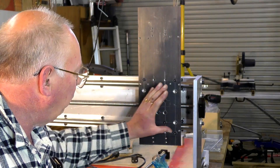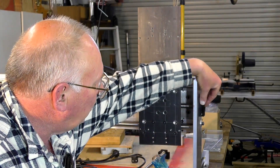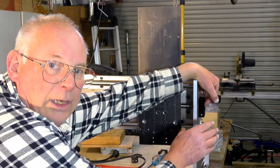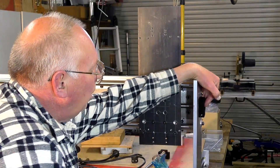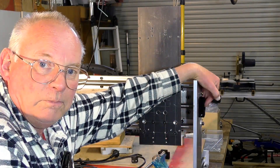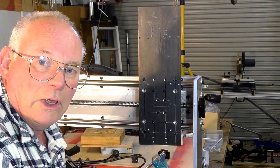I've taken this over that way, so it's about two inches distance here. But this bearing is now firmly fixed, and that's where it has to be. So what I'm going to do now is clamp that bearing housing to the upright of the gantry, mark the holes, drill them, tap them, and fix that bearing in place. Then do the same operation for the bearing at the other end.